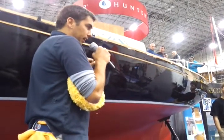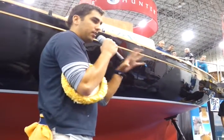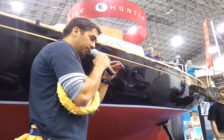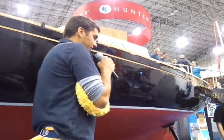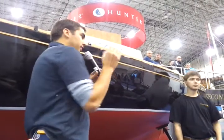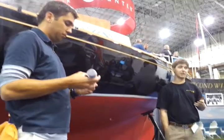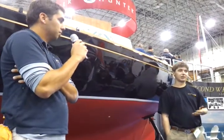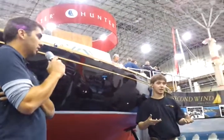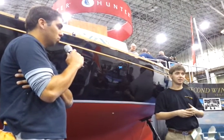Whatever the surface, whether gel coat or paint, we're just talking about oxidation, calcium, iron, these minerals, this crap in the water that's dried on your boat, dirt, soot, just forming that film layer, a thin layer, and we're just polishing that off. That is the essence of what we're trying to tell you guys. We're just restoring. Something that I've tried on an S2, actually, is much like wet sanding, because I used a scrub brush and Scotch-Brite. The stuff you pour out, so that's almost like wet sanding it in there, and I was able to get it really, really shiny in that sense.